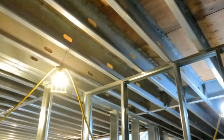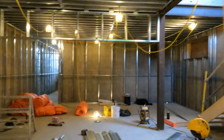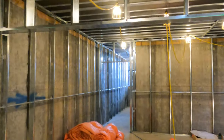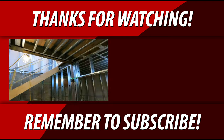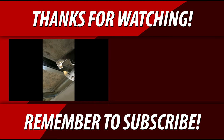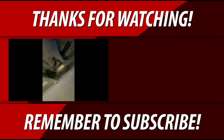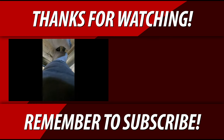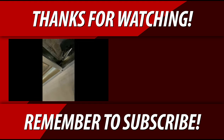Always check your layouts ahead of time. For window wells, I laser them down, square them across, and copy the window opening so there's a drywall return at the window. Final trick: crimpers. For frost walls you have to crimp the backside of the stud, but do not squeeze your crimpers all the way. There are two levels — just go half crimp. Do not go full crimp.